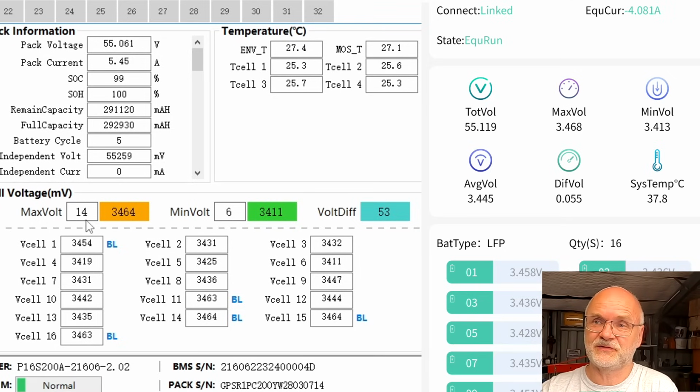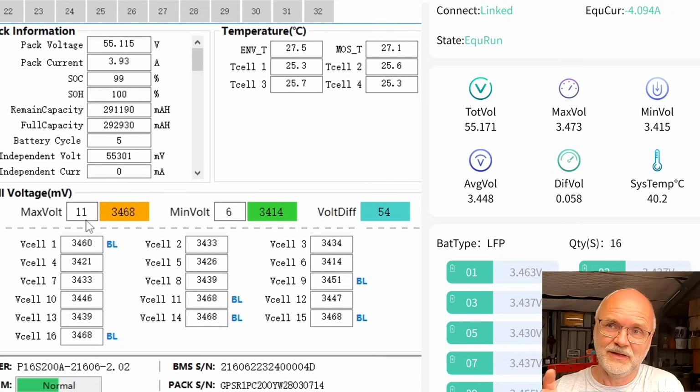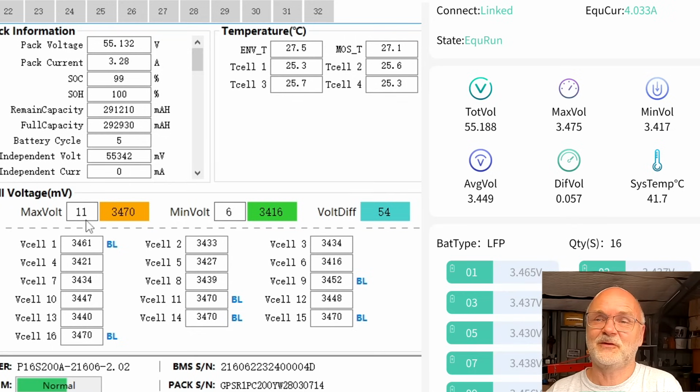And they are both working together now to get this pack under control here. So none of the cells should actually see 3.65 volts. And we can already see here now that we can actually charge higher, to a higher voltage than we could before with the other balancer connected all the time. Still having 55 millivolt deviation. So charging current is now under 4 amps. That means our balance current of the active balancer is higher than what we charge into the whole battery. And only when this happens, you should actually start balancing.